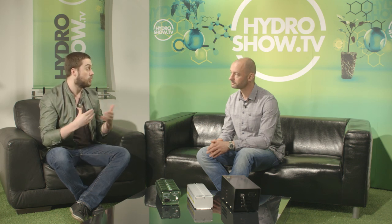With the first magnetic ballast, we talked about flicker. Is that eradicated with the new digital ballast? Yes, indeed. They regulate the flow of electricity, so they run the bulb at a constant lumen output, as opposed to a magnetic ballast. That obviously passes on advantages to your lamps in your grow room and in turn will make them more efficient.